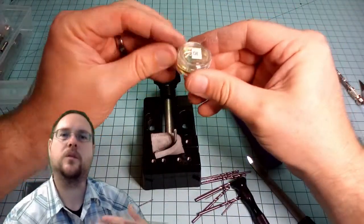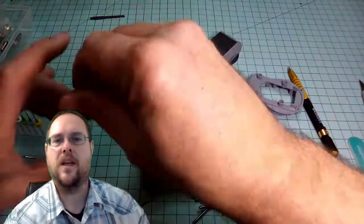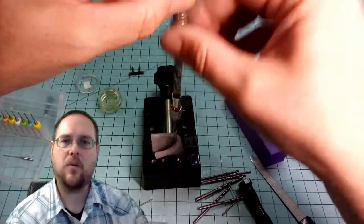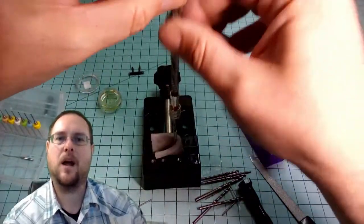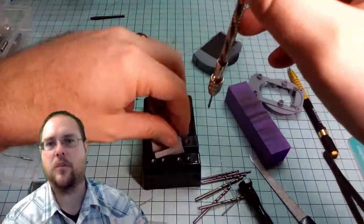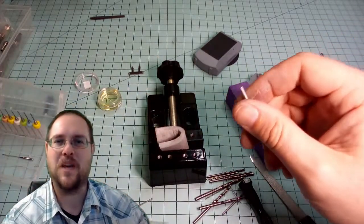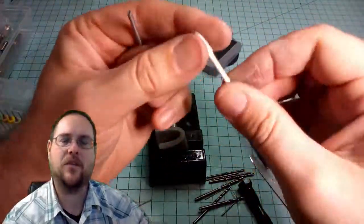And one thing that I wasn't doing right off the bat was using oil. And it dawned on me, when I'm out in my workshop working with my drill press, whenever I'm drilling into metal, I always use 3-in-1 oil. I always have 3-in-1 oil for putting in screws on the metal builds. So I ended up grabbing that. It helps with the cut of the drill bit, keeps the drill bit from getting too hot, and helps to prevent or slow down damaging the drill bit. So just basic 3-in-1 oil is what I have on my workbench all the time, and that's what I would be using.